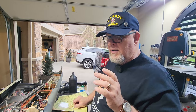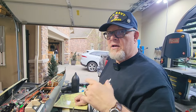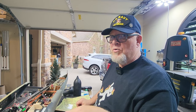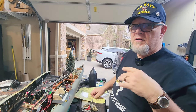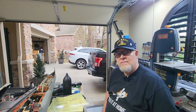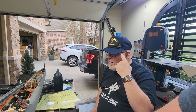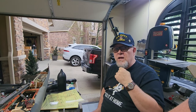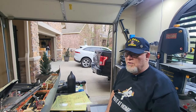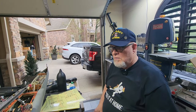And there were some odd things. Can we comment about the wire gauge? Yeah. He used what appears to be 18 AWG throughout the boat, including feeding the motors and the main 12-volt distribution. So those could probably be bumped up. Fortunately, under full tilt, those motors really shouldn't be drawing more than three amps. They'll handle it. It's just not ideal. You're not spiking 50 amps through it, less than 300 milliseconds. You're going to be fine. But it's just not good practice because there's also voltage drop with the smaller gauge wire.